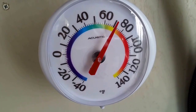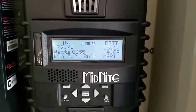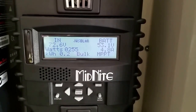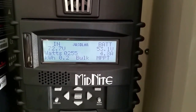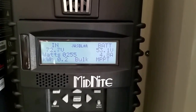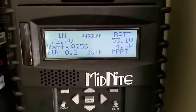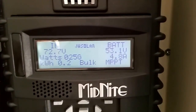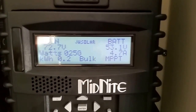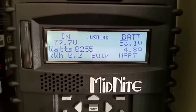This is the temperature reading by the batteries right here. The 24 volt system — as soon as there's a sudden load, the fan comes on and runs until some of the appliances quit and the load falls off, then the fan goes off, according to the dip switch settings. I haven't done anything yet with the dip switches on the 48 volt system, which is still working quietly — no fans at all. It's cool to the touch and runs perfectly.